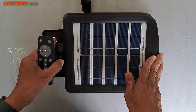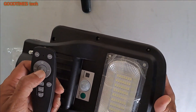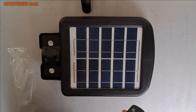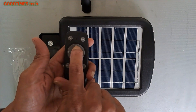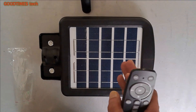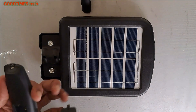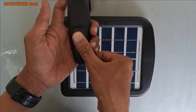The enter button is for mode. When you press the mode button, the LED lights switch to automatic. The center sensor — a radar sensor — senses movement on the street or in the garden or balcony, and automatically increases the brightness. After 10 seconds, the light will go back to 10%. Using the up and down buttons you can keep it at 50% brightness to save the battery and increase backup. The battery used in this device is a 4.5 Ah, 3.2V LiFePO4 battery.